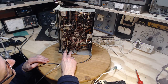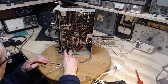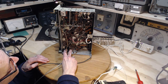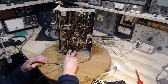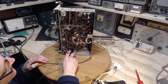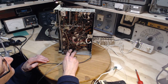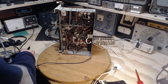There's a resistor here. On the other side, that's all that's on the capacitor in the power supply, 45 volts. So it's all present on this other side of this resistor. Not much left, you know, and what's right here? Here's a capacitor. No, that's a different pin. Oh no, that's a pin. That capacitor goes to ground. You know, this thing could be leaking, pulling down the voltage here. Probably what's happening. I can't be absolutely sure.